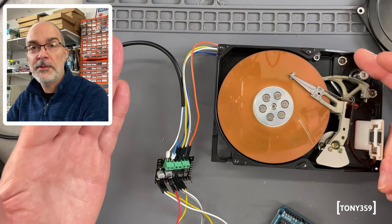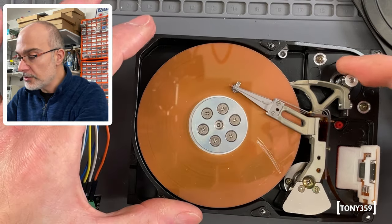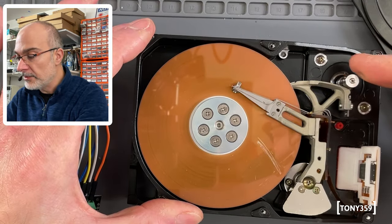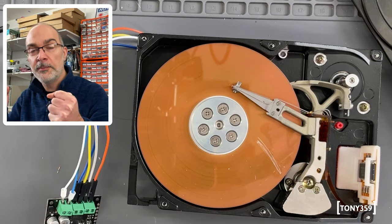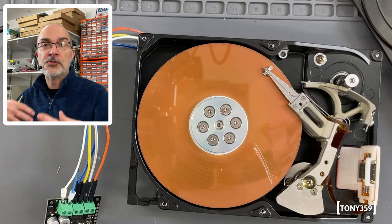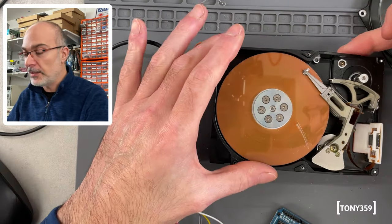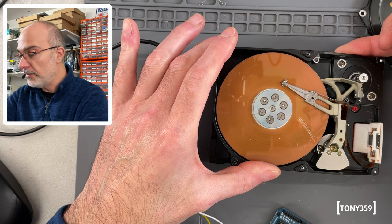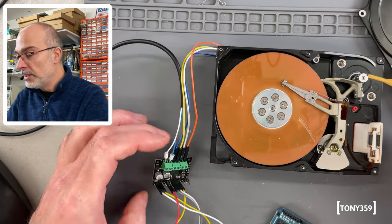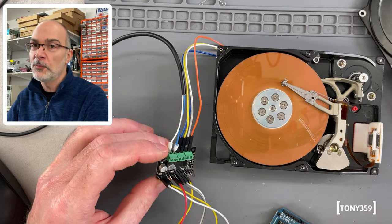So if I'm now giving power to the motor again, you'll find that I can't actually move the motor when it's idle. It doesn't move because it's locked in position by the coils, basically, by the current running through the coil. That is not the voltage, but the current. I have to limit the current, otherwise the motor will catch fire. I think it's pretty warm right now. But when I do that, it makes this weird noise, which I don't want to hear.